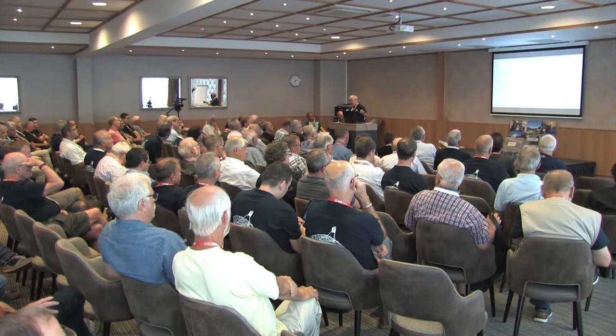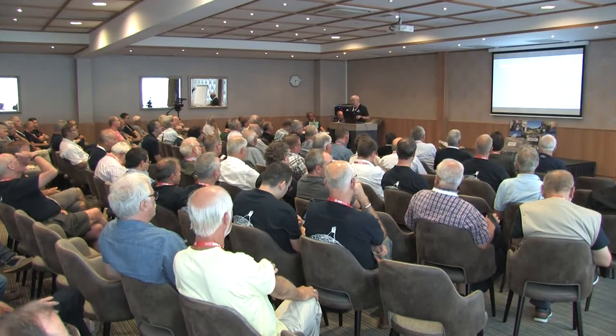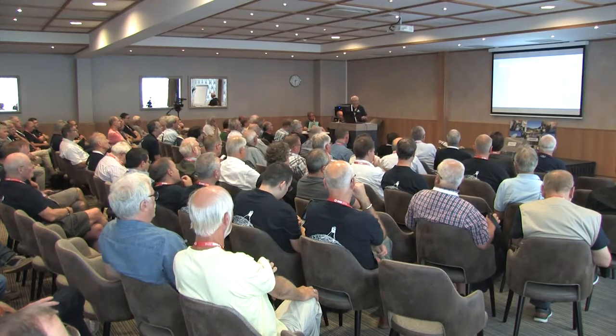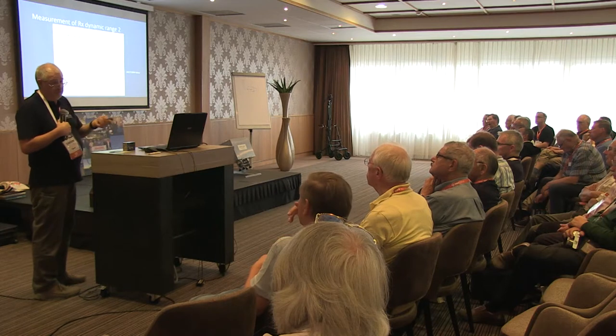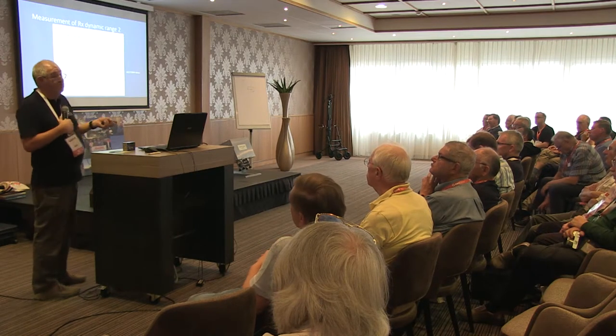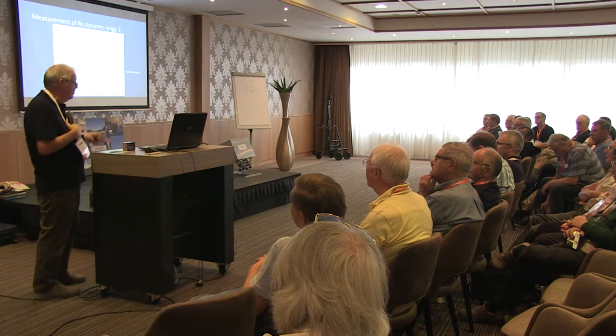That's the bit that your receiver is most worried about, and that wants to be at least comparable and probably better than your rig. Put that into an FT817, well, you're going to do that anyway because it's already got 70 cm, but a TS120 maybe? Oh my goodness, the TS120 is going to fall over long before the transverter does.